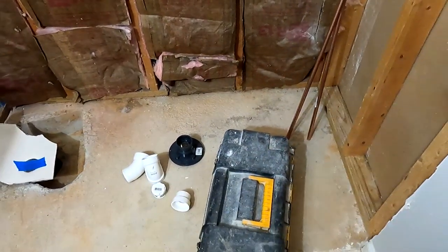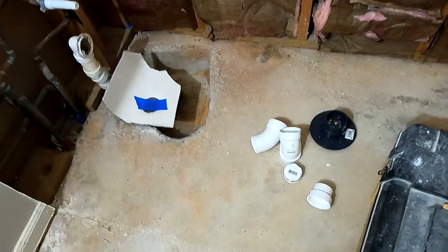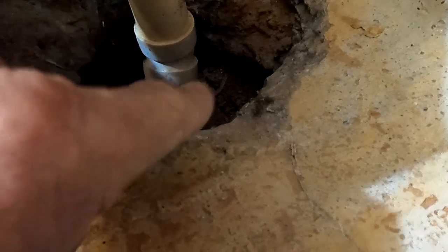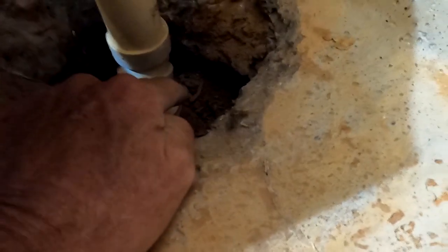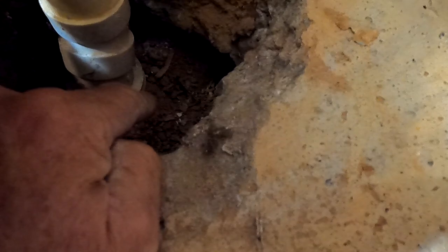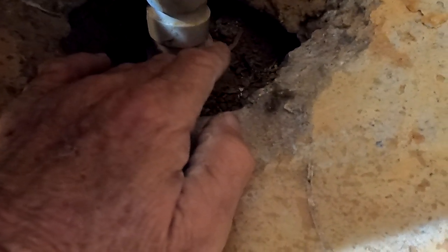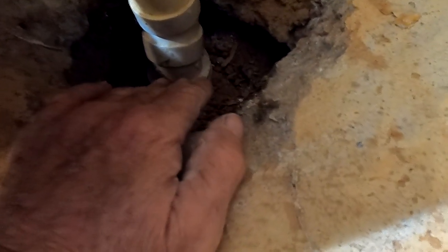I'm making this video for those of you who want to know about tub-to-shower conversion. Some of you are kind of confused as to how the process starts. I've done two or three videos on how to do a drain on a concrete slab, specifically a tub-to-shower conversion. The grade is down here in the dirt, and it's usually about 10, 12, maybe 14 inches inside from the top down to where the p-trap is. Nobody — not even a plumber — is going to dig into all this concrete to get below grade to swap that p-trap out to a two-inch. That's not going to happen.